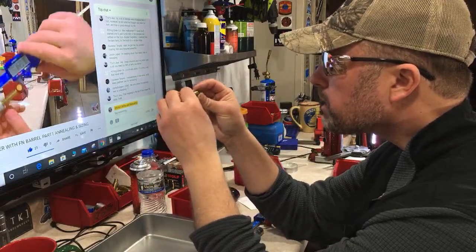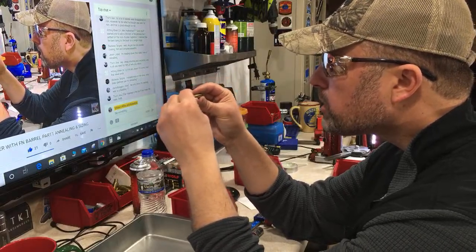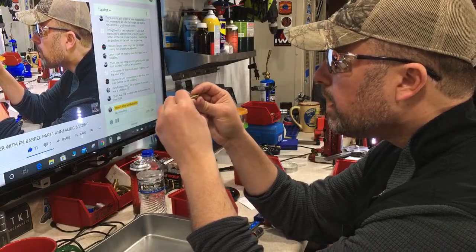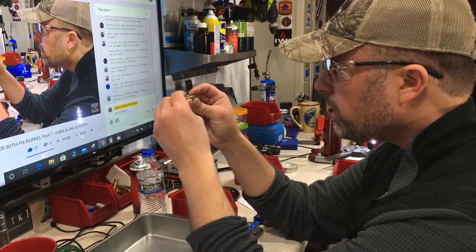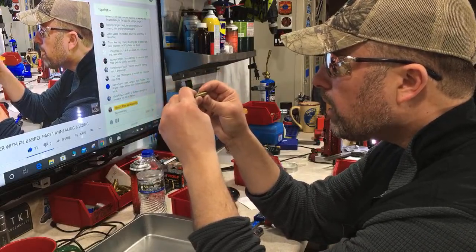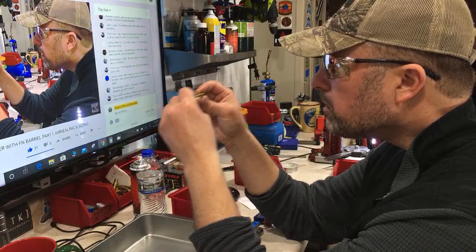So someone else fired this piece of brass out of their firearm. It custom sized to that individual firearm's military grade, most likely fully automatic type firearm headspace of a ginormous 460 headspace. And I just bumped that down 7/1000ths of an inch to 453. And most likely when I fire it, it's going to re-expand to 457-ish, 3/1000ths of an inch. Now, the name of the game is you want that brass to seal off in your firearm's chamber as soon as possible.